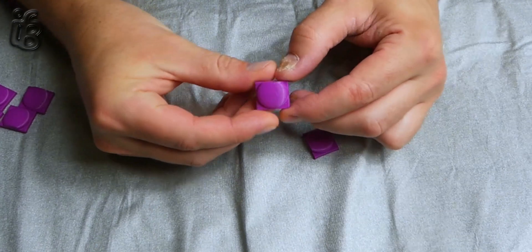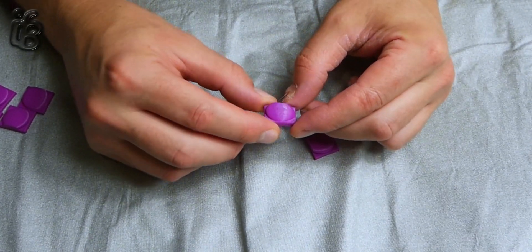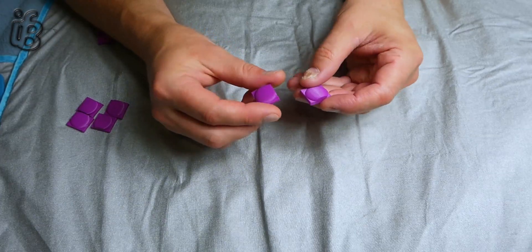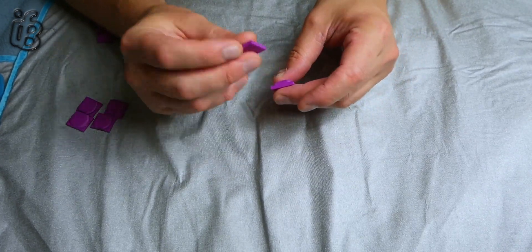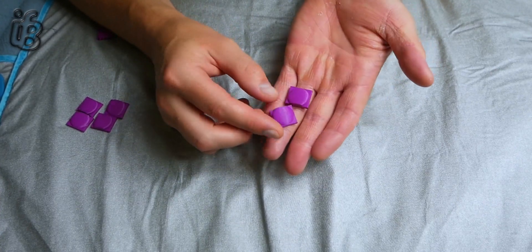As you can see, these are actually lined slightly off-axis — I believe they're kind of angled slightly. What that does is just slightly offset it by so many degrees, so you can find this little phenomenon. And as you can see, if I move it around like this, you can see the little circles. It doesn't really make that much of a difference. Now if the U30 was using the DRV8825 stepper driver, then it would probably be a lot more of a problem, but this is only very slight.